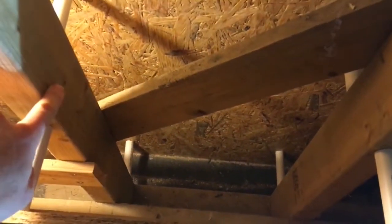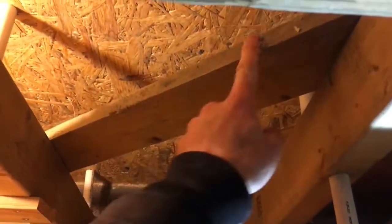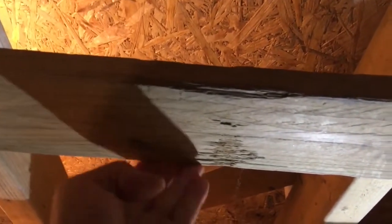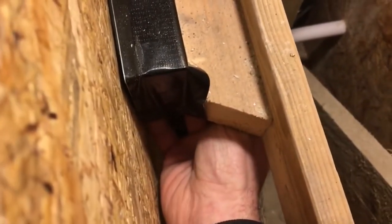The frame itself is designed to avoid horizontal members as much as possible, which is why this one is on the diagonal. Where you do use a horizontal timber, try and make it as thin as possible so it's easier to tuck the hempcrete in underneath it. Even then there are obstacles like the socket here, which is going to be hard to push hempcrete in underneath. Further down behind that is an area that might be just a little bit far for one arm to reach.